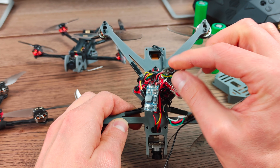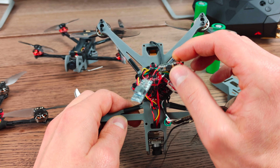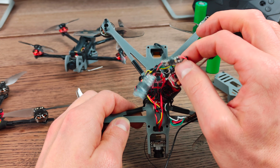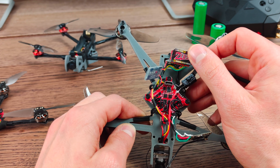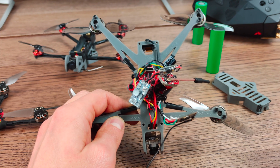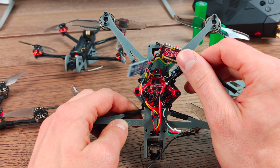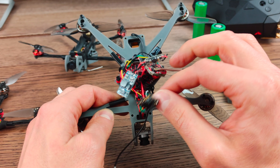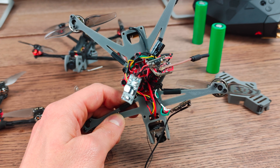Another thing in here is this LC filter, which simply filters the power supply coming from the 5 V step-up, because this tends to be quite noisy. There's a little extra LC filter, and that's basically everything we need to solve this low input voltage issue. The wiring diagram is on Thingiverse, so you'll be able to look up how to exactly connect all of that to make it work with the lithium ion batteries.